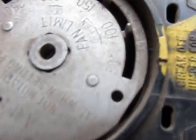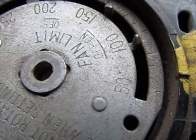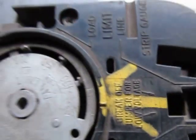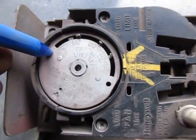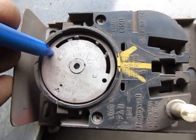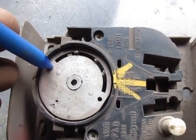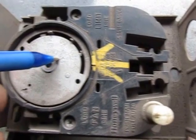If you'll notice here, this temperature clock turns — there's numbers on the clock: 50, 100, 150, 250. That should be within 10 degrees of shop temperature before the unit ever starts. When the unit's cold and the shop's cold, say 50 degrees, this thing should be within 10 degrees of 50. If it's further than that, replace the control.